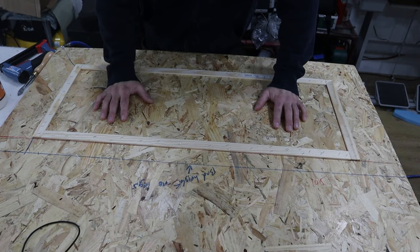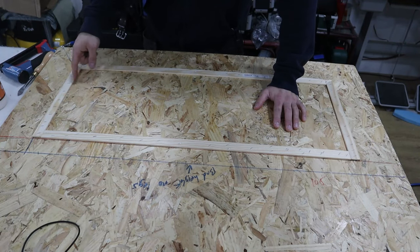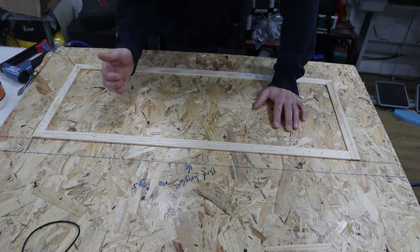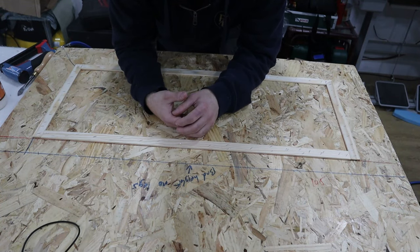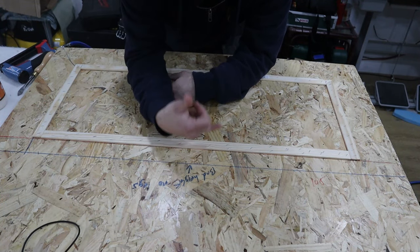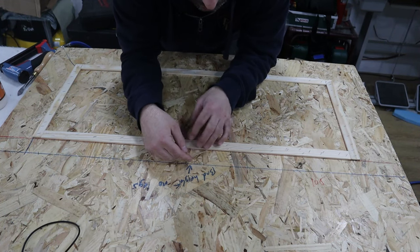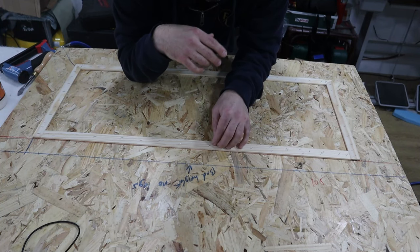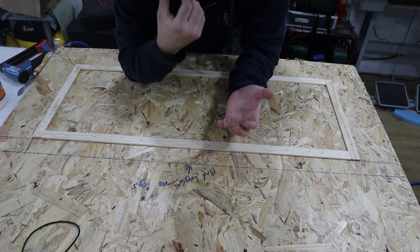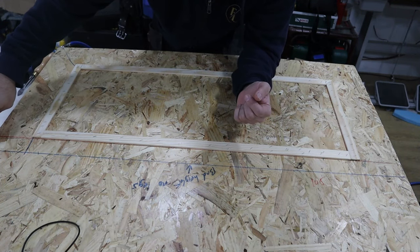You can apply this to any sort of headboard you're doing. This really thin wood strip is great — you can cut it to the size you want and it gives you a nice hard edge to finish on. Sometimes when you're doing this free-handed with no edge you've got to keep checking your line, whereas if you've got a hard edge like this it makes it a lot easier to finish because you can just follow that line.